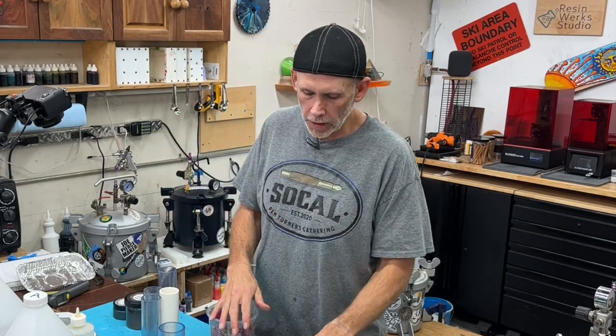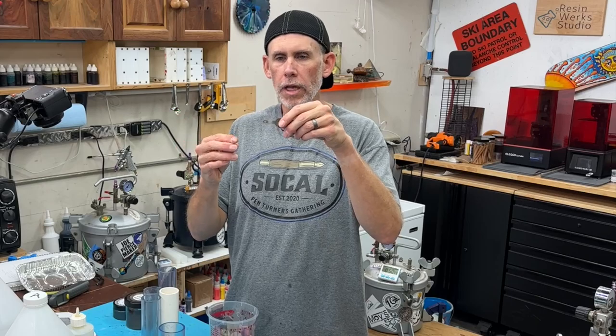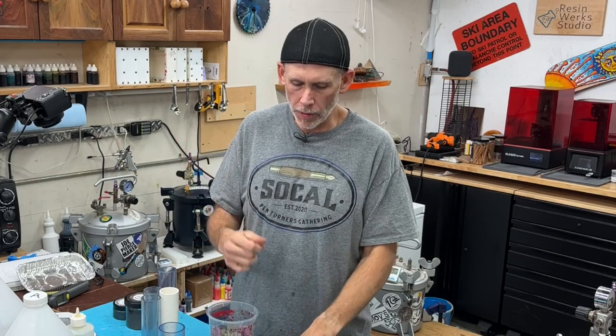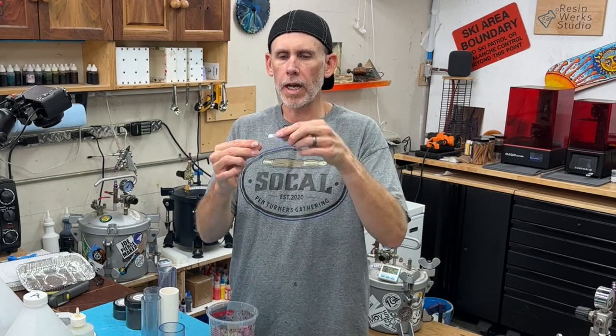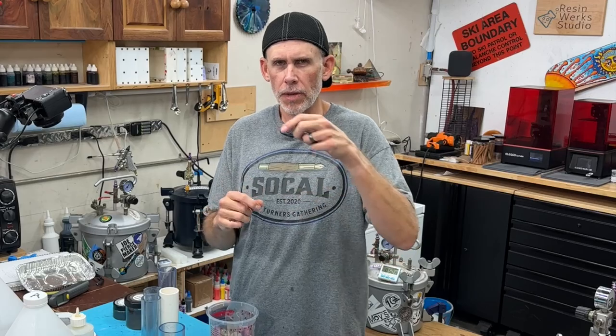Now for the work holding, I'm going to go for the stopper mandrel work holding method. The way these work, you just drill a hole in your blank and then glue this thing in. They recommended a 7mm hole. I think that will fit this thing pretty tight. One thing I'm a little worried about is if it's too tight with a resin plastic blank, this may be hard to jam in there.